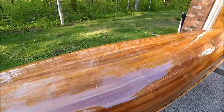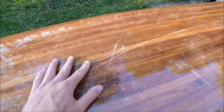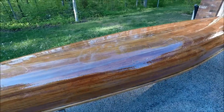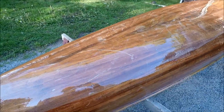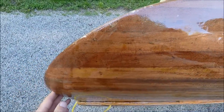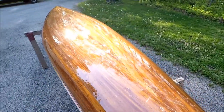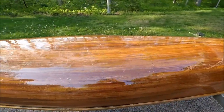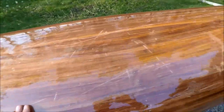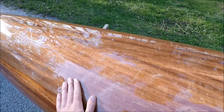Another beautiful day outside, just looking at the finished canoe. Two extra layers of epoxy on here — a couple of the deep spots we couldn't exactly buff out, but it's protected now. It's hard as a fingernail on top. I stayed up a little late last night making sure there are no runs. You can see at the bow where I put in that filler piece — it looks a lot better than looking at that white. I'm pretty happy with the results. No varnish going on this because it's going to be inside most of the time and only out when being used, so UV rays aren't a concern. Thanks for watching, hopefully you learned a lot, and we'll see you in the next video.